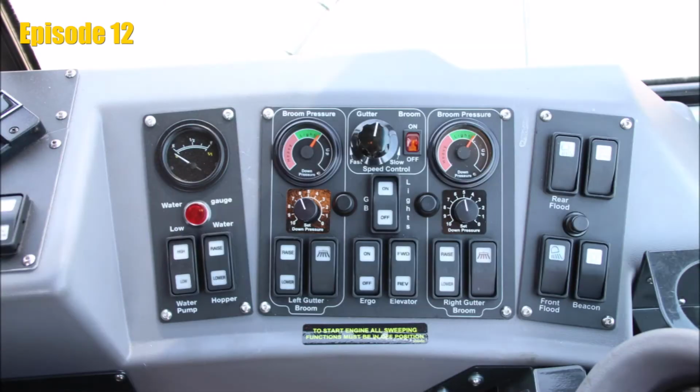Now I'd like to review all of the sweep functions and gauges in front of you. On the top left side, you will see a water gauge. This gauge will show you the amount of water you have on board that can be utilized to control the dust for sweeping. If the gauge needle indicator is close to empty, please fill your water tanks before you begin sweeping operation. Right below the gauge, you'll notice a red light. The light will illuminate only when you run out of water. Again, when you run out of water, dust control will not be available and you're required to refill the water tanks.